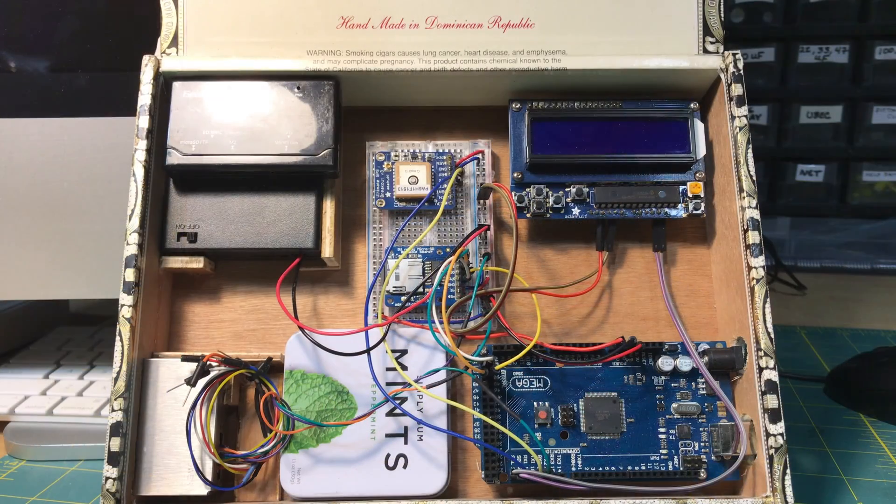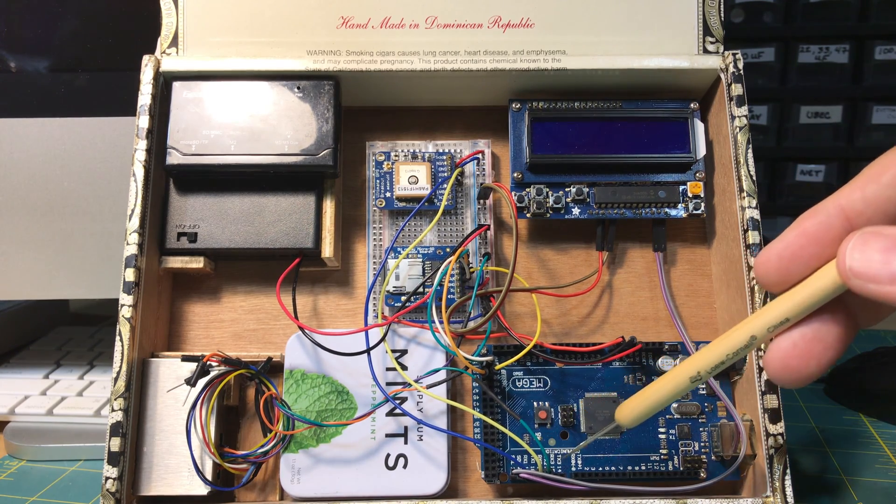When I originally tried wiring up all this hardware to an Arduino Uno, I quickly discovered I needed two hardware UART serial connections to talk to the air quality sensor and the GPS. In the case of the Uno, I only have one, whereas with the MEGA there are three extra serial connections available.